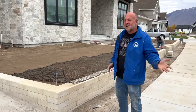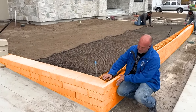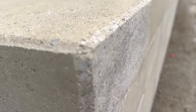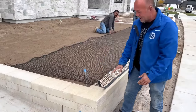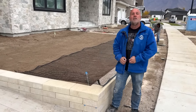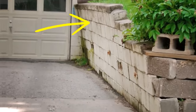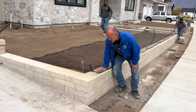We are getting so close to finishing up this house. We're into the landscaping phase — it's been back and forth for a while now. I'm finishing up this block wall. Sometimes a lot of people just chop the edge, but it's worth spending a little more time beveling all the sides, even on a cut edge — it helps it look more factory cut. This geogrid mesh — it's not a very tall wall, a lot of guys won't start using it until three or four feet. I really don't like to do that where we get the winter freeze, where moisture gets into the soil, freezes, and tries to push the wall outward. Each year the wall works out, dirt falls in and doesn't go back. So I like to geogrid it back — tied back with a concreted base.